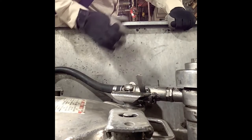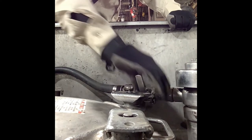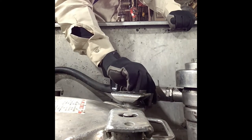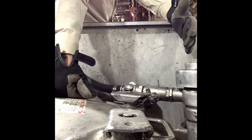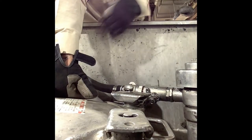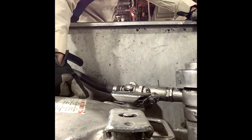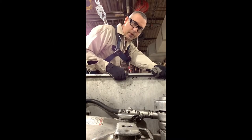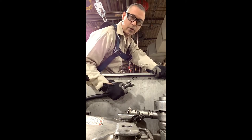What you'll want to do next is go ahead and there's a ball valve up here. This ball valve — slowly open it. That should relieve any pressure that's inside the trailer through the hose out onto the fender, where we already opened the ball valve and uncoupled the Chicago fitting. At that point, if need be, release the unload hose.